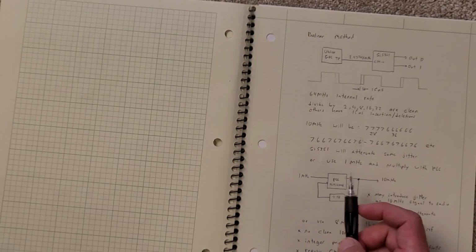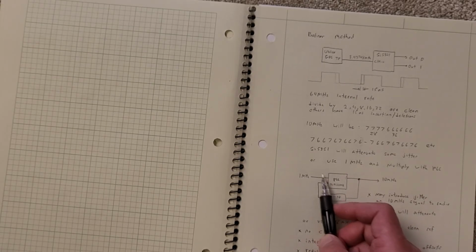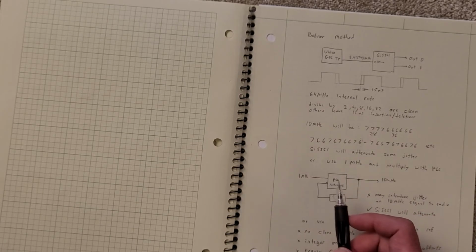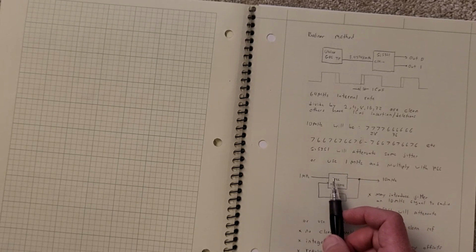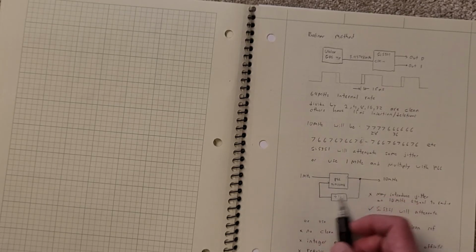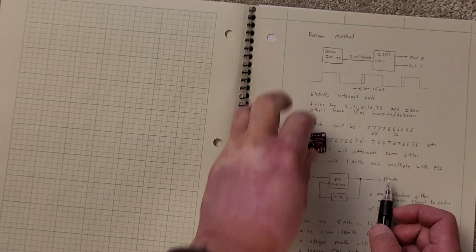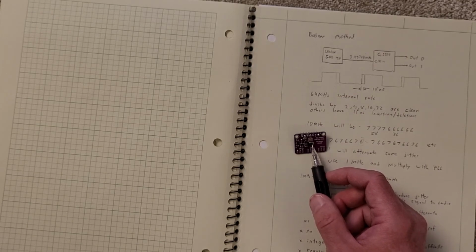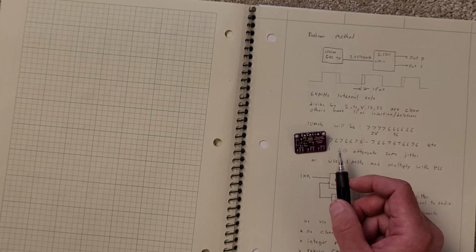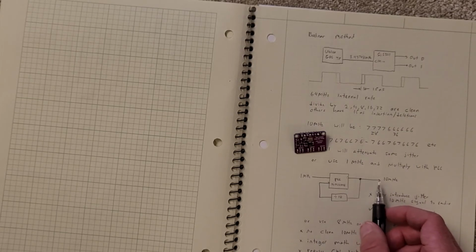And this is how frequency synthesizers actually work, because if I had a divide by 2 over here, then this would be comparing it to 10 over 2, so I get 5 megahertz out of here. So this should clean up this nasty jitter, although the VCO inside here may or may not be completely stable, but it's a PLL, and I'll for sure get 10 megahertz out. I'm not sure how much noise I'll have. And again, for frequency synthesis purposes in the frequency measurement test, that's probably okay, because if I want 14 point whatever megahertz coming out of this device, I'll get that, and that's what I use for the FMT. But for clocking the radio, if I really want a perfect 10 megahertz, this might not be as good.